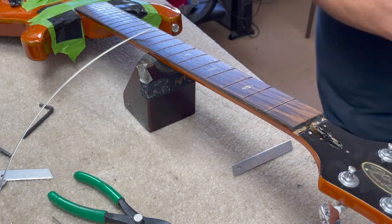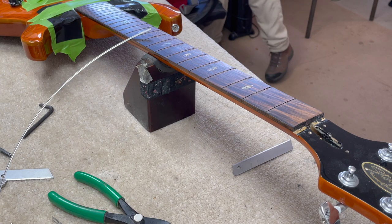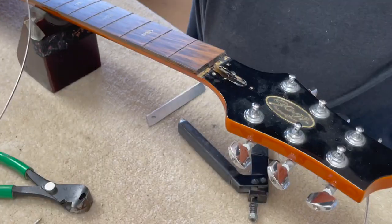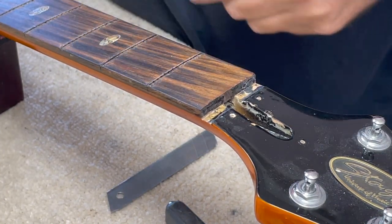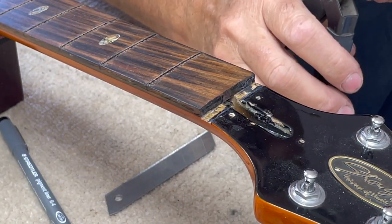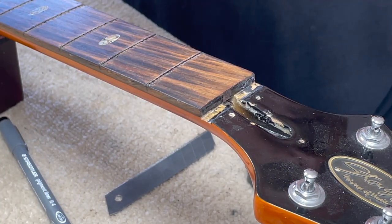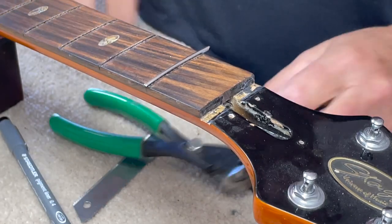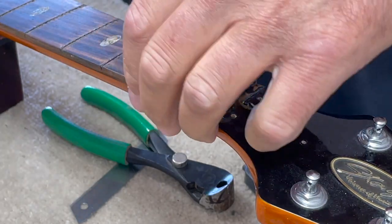Now the problem with that, I've got to get me nippers and so on, and I'll show you what we'll do if we're cutting an overhang, like with a binding. Remind me, I'm zoomed in. So I've got enough spare to do this little test. The first thing I do is get my tang nippers and attempt to cut the overhang, and I'll cut this flush. So we've got a little bit of overhang, a little bit of not overhang. Then we'll line it up like that. It seems to be seating quite well. And then we'll go to the other end, cut it to length first.